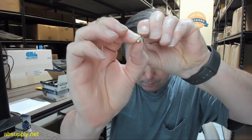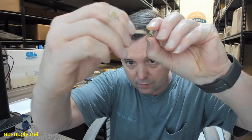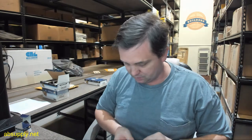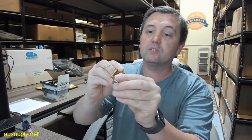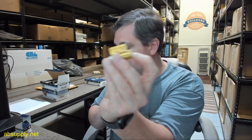That C-clip is going to go in there, allowing you to rotate that cylinder and tail piece. There's also a shim that comes in, and I've spoken to technical support at Kaba Ilco about this, and they've told me that sometimes the cylinder is ever so slightly too short and moves a little bit, so they will tell you to place that shim right behind there if that's the case. That's why it's included.